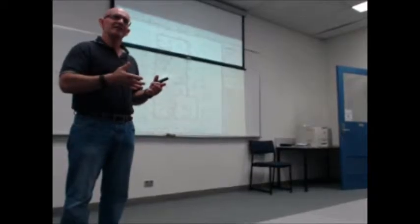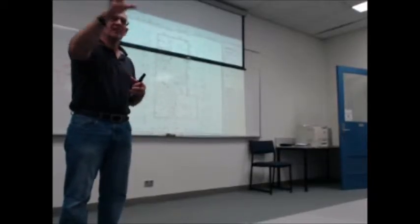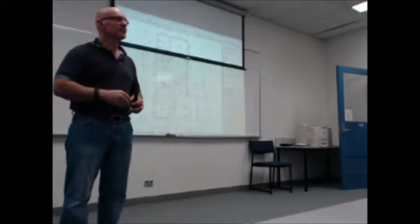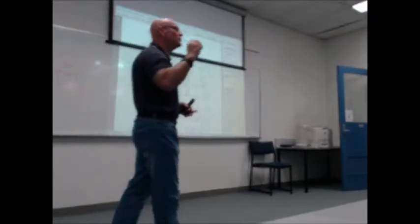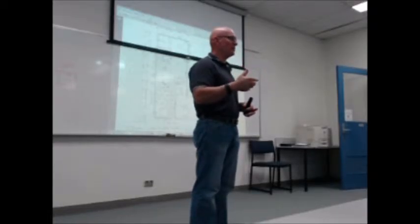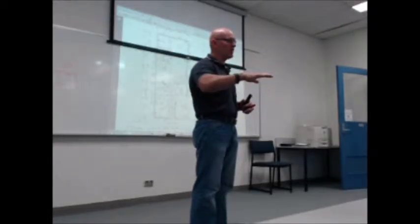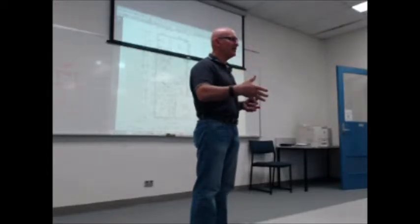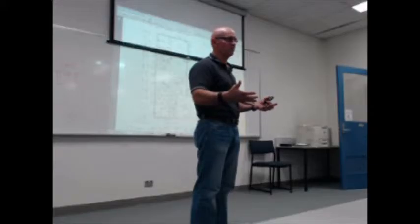Mm. It doesn't look like it, the tile is a pretty good job. Why is it only here and there? It's not just the odd spot. Wouldn't the tiler say something? Yeah, but that amount you don't see when you're laying it. It's only when you start grouting it that you might pick up on it because there's a gap from one to the next. That's when you might pick it up, and then the tile's laid, and you're just going, oh, hopefully I get away with it.